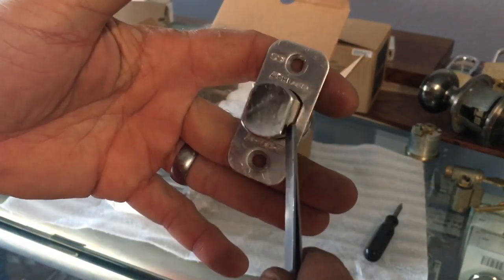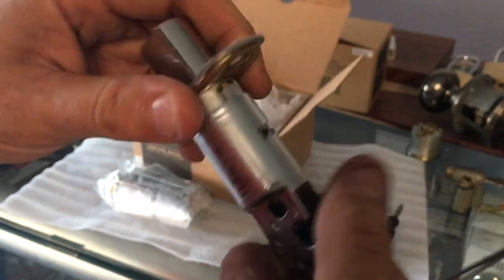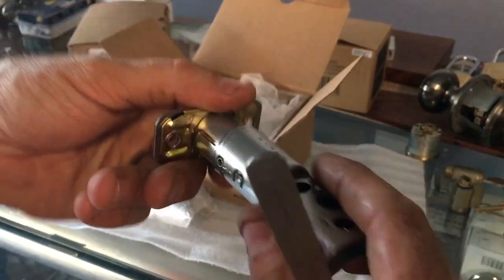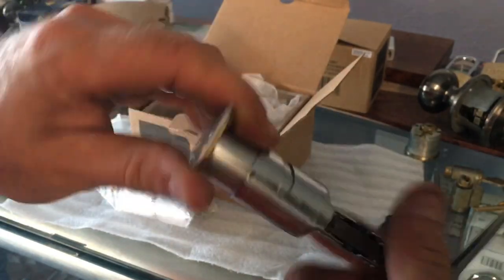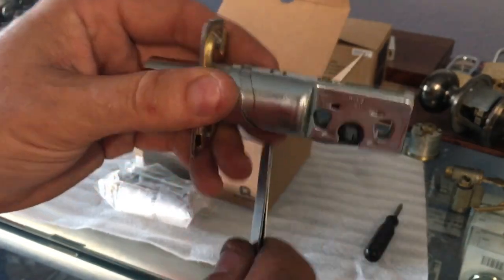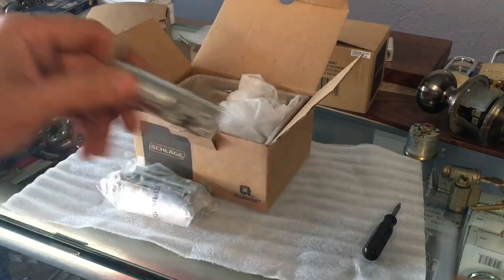It's a bigger diameter, 15% bigger than regular locks. It is very beefy, steel body, roll pin for the changing mechanism when you need to switch it, very easy to change from 2 3/8 to 2 3/4. People don't chisel it deeper, just twist it. It makes it long instantly. You don't have to go to a lot of trouble to change the backset. Very beefy mechanism here. I've yet to see one of these break. I've yet to see one break in a door kick-in either. So that's kind of a notable thing.